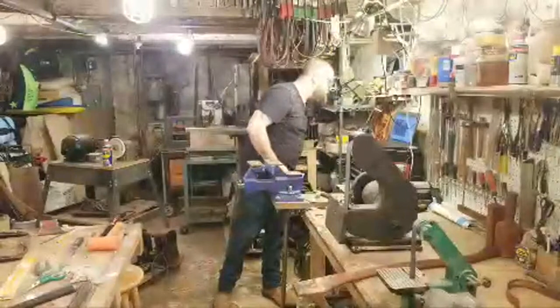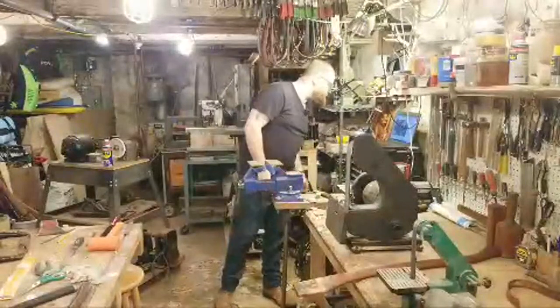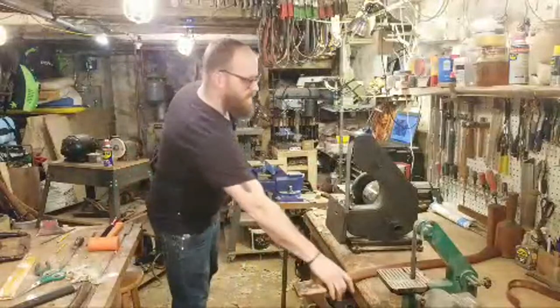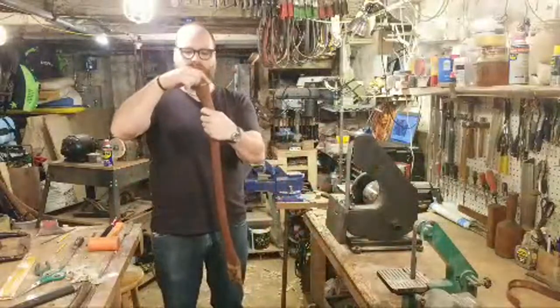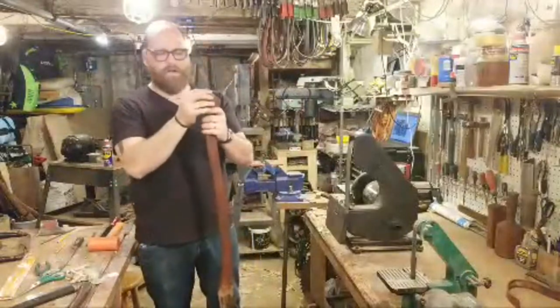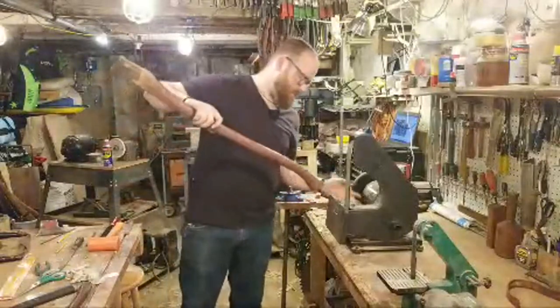Chainsaw file. Dustin Chavers said chainsaw file. Yes, I was using a chainsaw file. All right, so I'm just going to quickly grind a quick chamfer on that, so that way, again, when I'm hitting on hair, it doesn't want to chip out.